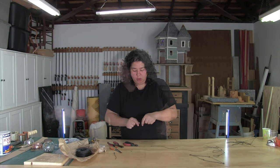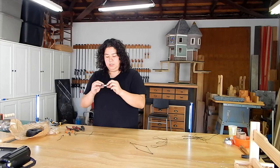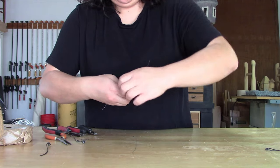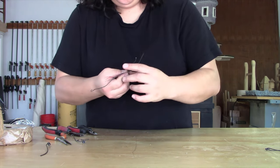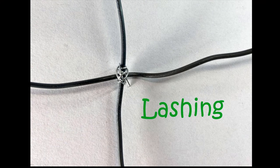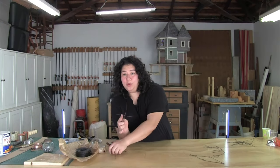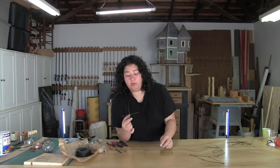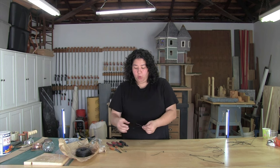Lastly, I'm going to show you the lashing method. Let's say you have two pieces that come together at a center point — take a thinner wire, fold it over a little bit just to get going, loop it under, and then begin to twist and lash the two pieces together. You might want to think about doing this in a decorative manner, paying attention to how you're twisting so that it looks like a good joint. If you're using a small enough wire, that might not even matter. With a thicker wire you'd be looking at a larger mess, but it is an option.